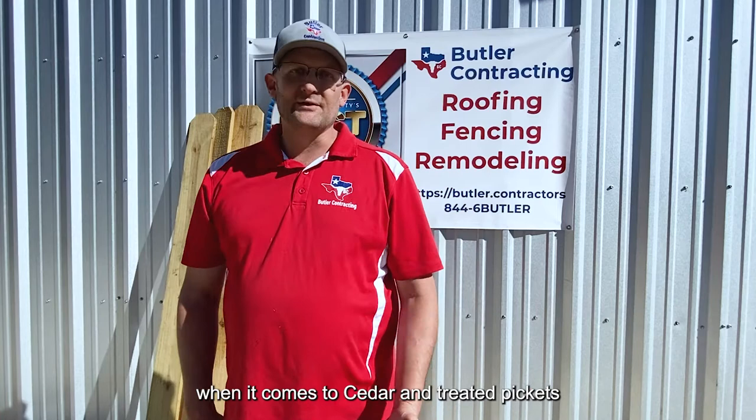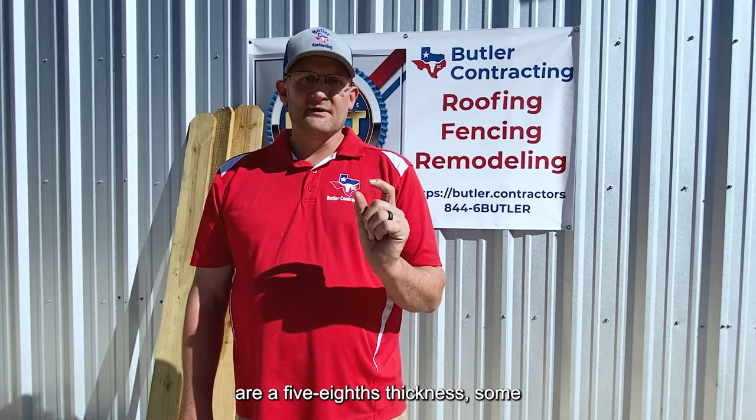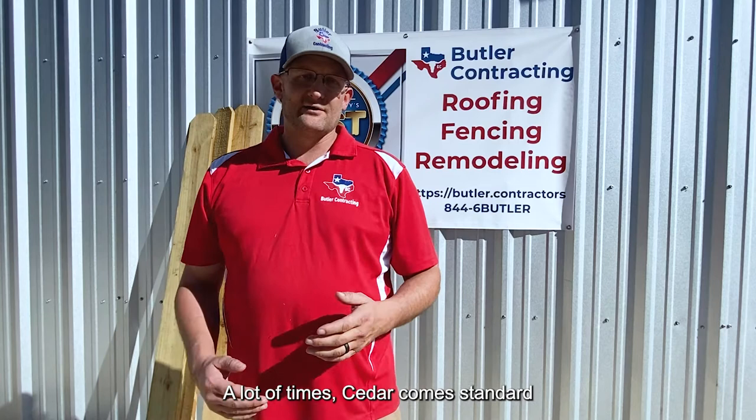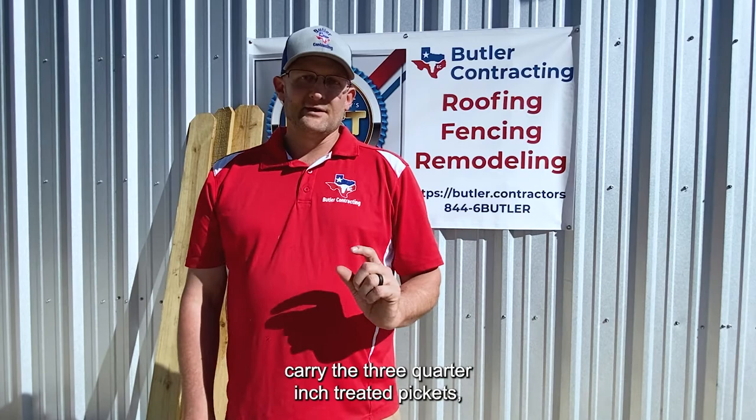your fence. One, there are some different thicknesses to be aware of. Sometimes certain pickets are a 5/8 thickness. Some are a 3/4 inch thick. A lot of times cedar comes standard in a 3/4 inch. Treated can be purchased in 5/8, which is thinner, or 3/4, which is larger. Most big box suppliers in our area don't carry the 3/4 inch treated pickets. They only carry the 5/8 ones.